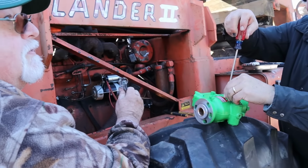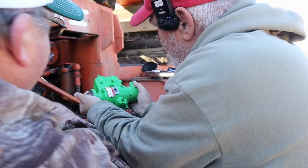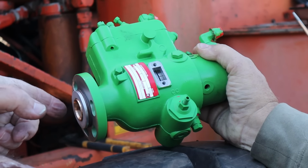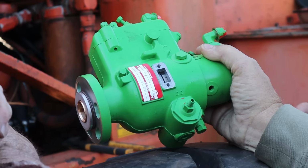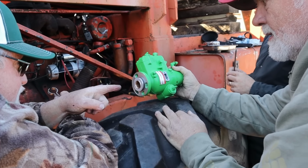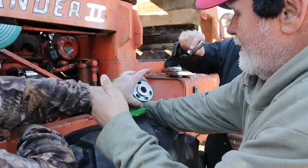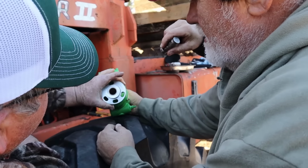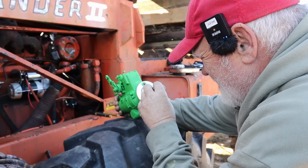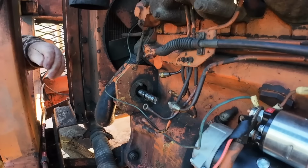I brought the book. That's all right. Wiley can't read anyway. That's not timed the way he and I had it, because we had both lines on it. Yeah, we got to time that line back in to match the dots. See, there's a dot in there inside your thing right there. You see that dot in there? On the left side. It's right where the end of your groove is. See that dot on top? Yes, I do. That's got to be timed with this here.